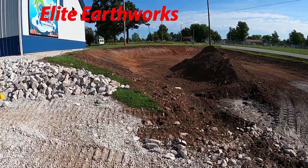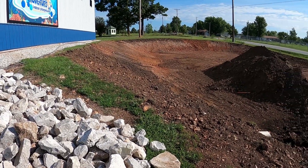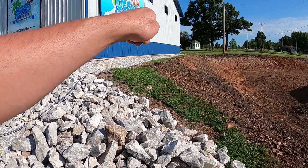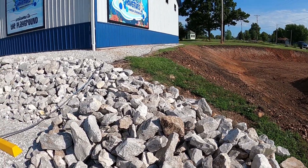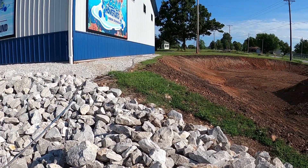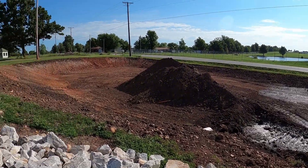We are back again and it's loader day. I'm going to try to come in here and concentrate on cutting these slopes back a little bit more and getting them tracked in. I may take some of this better stuff and try to top dress some of it. I really need to cut that grass along the edge of the base and kind of shape that a little bit more, because the loader started sliding sideways when I was on there the other day. That tells me it's going to be a little too steep to mow, so it may not quite be a three-to-one by the time we get done, but we also have to make it what's going to be a little bit easier to mow.